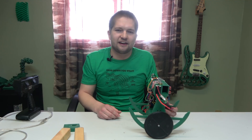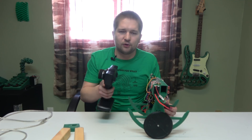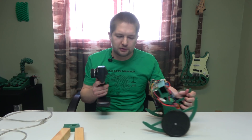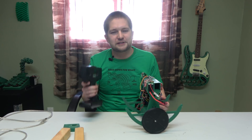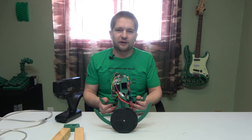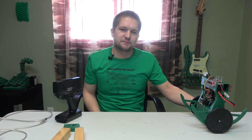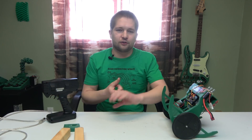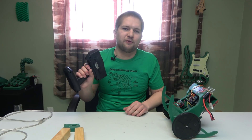The other thing worth mentioning: right now it is remote-controlled and does drive forward and reverse when I pull the trigger. However, the trigger is currently controlling acceleration rather than speed. When I pull the trigger it just keeps going and would eventually run out of wheel speed and fall over. I'll need to integrate the trigger position with the current speed and adjust the commanded angle so it drives fast when I pull the trigger and stops when I let go.